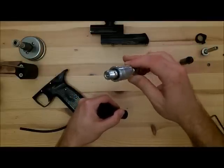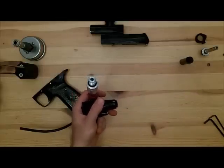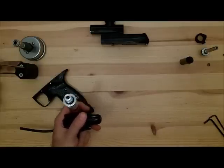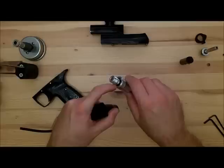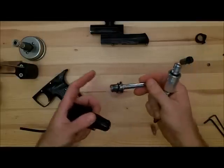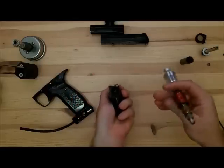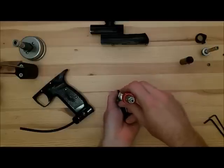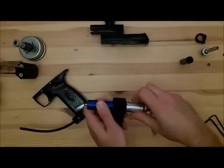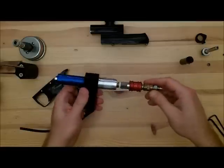Whether you pick this up from Staunchy or from CCM, what I did is put in another O-ring right on the front — that's the O-ring that fits on the pump kit guide rod. That is an N70 015 O-ring. I just put that on there so I don't have to rob it off my marker arm. It's permanently dedicated now. So set the spring straight up and down in here, drop this in, and carefully thread it in. It's aluminum on aluminum, so be careful — I would even grease it up if you're a little nervous, because it could gall, and you don't want it stuck in there permanently ruined. Grease it up a little bit as I did.